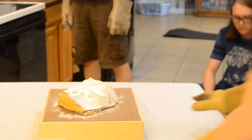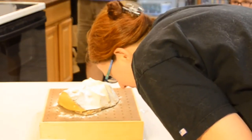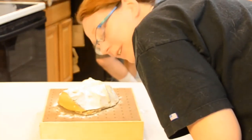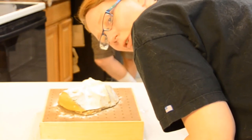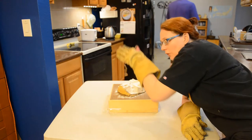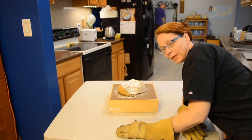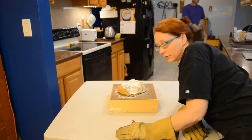I think this mold is going to fall apart — it's an old one. I've used it multiple times, but it's starting to crack from sitting out in the garage in the heat, so this might be its last hurrah. What he's checking for is the plastic starting to dip in the middle. Once it gets a little dippy, that's when you know it's warm enough to vacuum form.